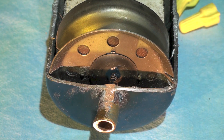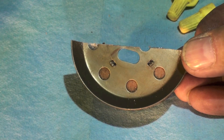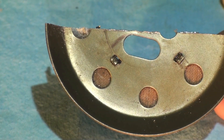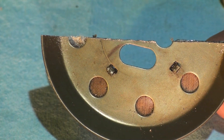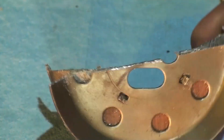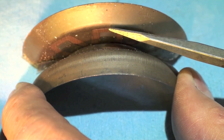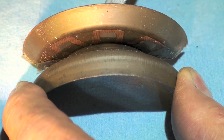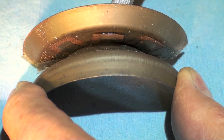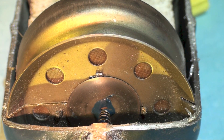Let's take a look at those valves closer. Here's one of the valve plates — you can see the valve holes there, they're covered up by the reed valves. Now looking at the other side, you can see these valves right here, and you can see I'm opening that one from the other side — just a little reed valve. So the refrigerant would pass through there.